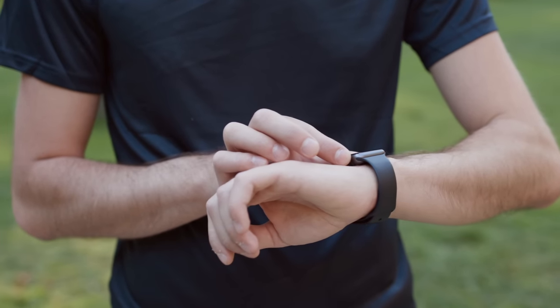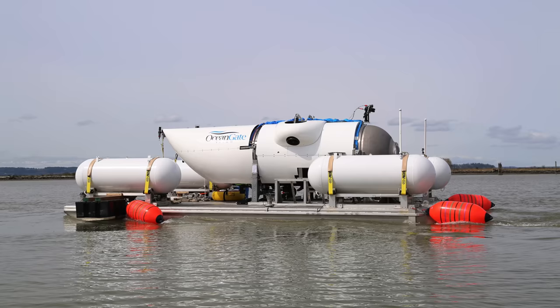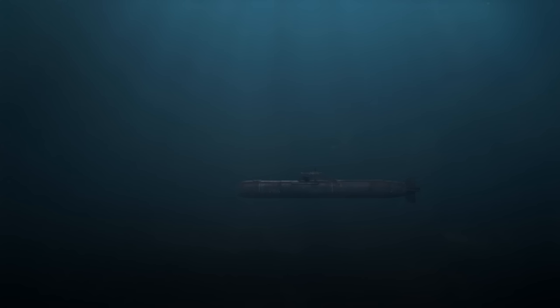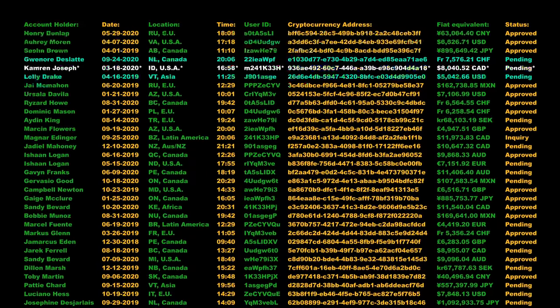But why? What's accurate time good for? Can't we just use NTP, or Network Time Protocol? Yeah, you can, and for most of us it's plenty accurate if you just need to know time down to the millisecond. But every day, more and more things rely on high-precision clocks. In VR, more accurate clocks means more accurate position data down to the millimeter. Or submarines — GPS signals don't get too far underwater, so you need a good clock reference to track time and position. And there are more traditional uses, like distributed science. Radio telescopes need to sync signals from different parts of the world accurately. Or in data centers and banks, computers have to have the same time everywhere to match up transactions.